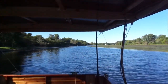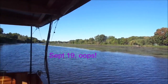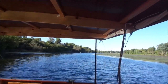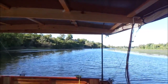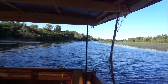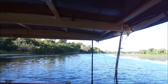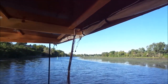I'm heading down the Napanee River. It's 20 after 9 in the morning, September 20th. Beautiful clear skies — it's a bit chilly this morning with a bit of a north wind blowing, very lightly though. I'm going to try some testing today. I want to get down river into a nice open area where I've got no shading, because it is early in the morning and the sun is at a low angle still. I want to test with the canopy flat, and then tilt it at about 5 degrees, maybe 10 degrees, and see what the performance is.